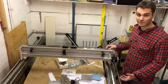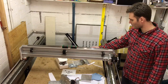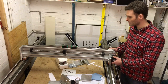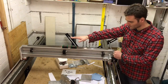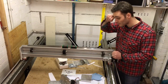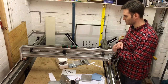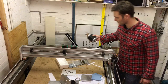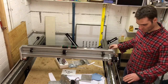I probably would have gone with heavier-walled stuff if I had my time again. This is aluminium profile and that forms the gantry, with stepper motors driving it. I've got NEMA 23s providing the power to the Y axis and the Z axis, which will go up and down here. Then the big axis — the X axis — will be driven by this big NEMA 34 and a belt that runs between the two ball screws.